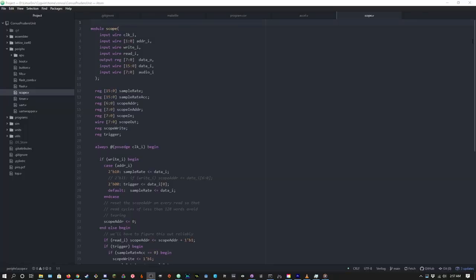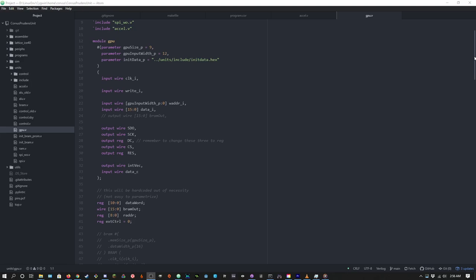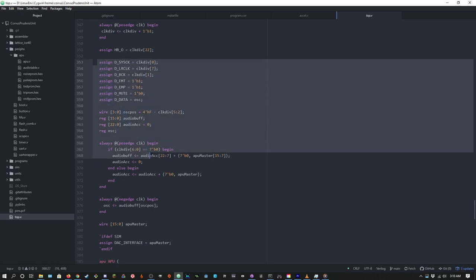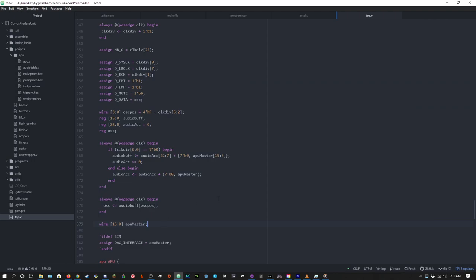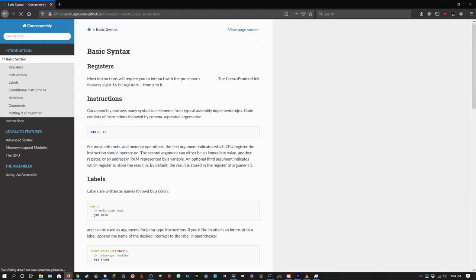I make up for this deficiency with the flexibility of the FPGA. I added an oscilloscope module that ticks away on its own and collects samples constantly — all the CPU has to do is read the scope's memory occasionally. I added a graphics processing unit to make drawing images to the screen quick and easy. I added an autonomous audio output section that constantly sends data to the DAC without any processor intervention at all. In order to program my CPU, I had to make my own language — a variant of assembly with higher-level features like loops and conditional blocks. You can find its documentation at my site if you're interested.